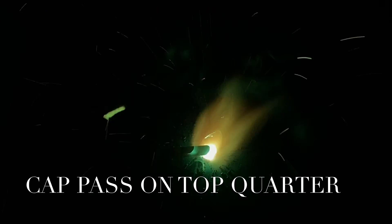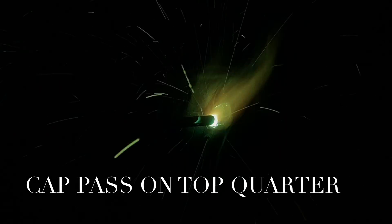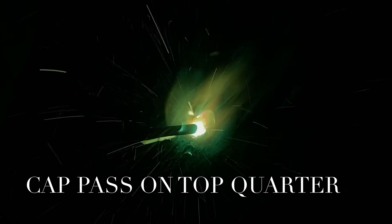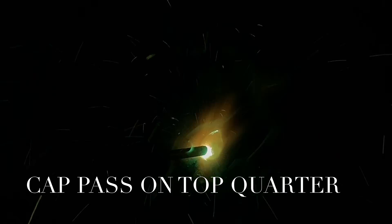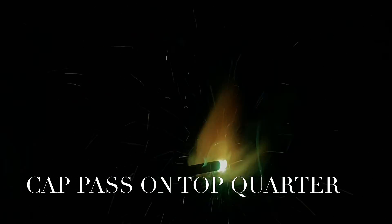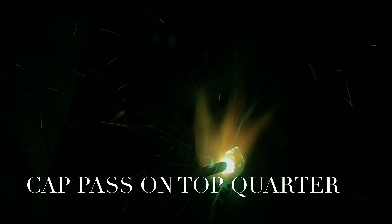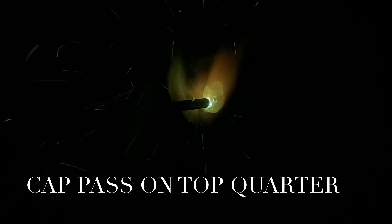Basically the fill pass is just a drag — drag it straight down. You can run small circles, however you want to do it. Just make sure you can control the puddle carrying the metal — make sure it's not too big of a puddle, and that you can control it and don't overfill it. You don't want to overfill the last fill. If you've got to run a strip sometimes right about 3 or 9 o'clock, it'll be low and you can run your little strip there. You want everything to be just at flush — right at or just a hair below flush. That sets you up perfect for the cap pass.